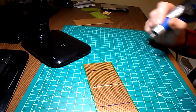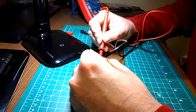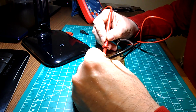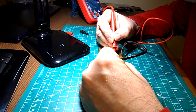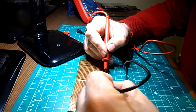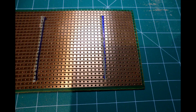Of course, you want to confirm the cuts are clean and there is no conductive path across the two sides of the cut traces. Here, I use a meter to measure the resistance across the sides to make sure. You should also visually inspect the cuts to make sure there are no copper whiskers that are too close together and that could possibly cause a problem down the road.